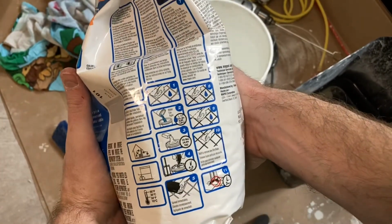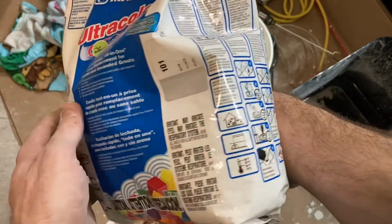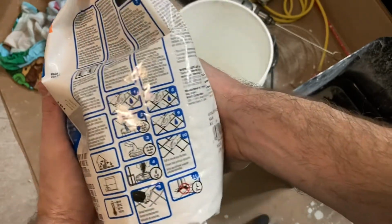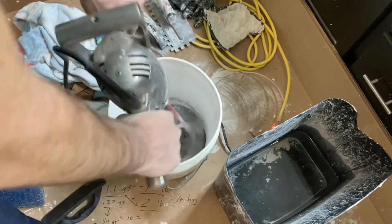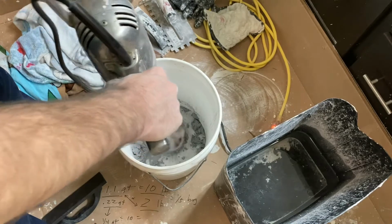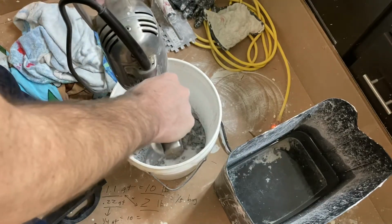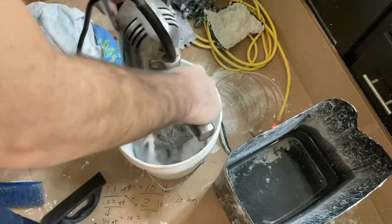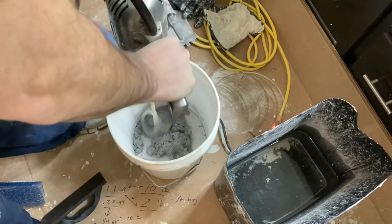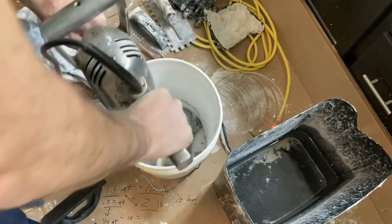And just a general tip here, before you mix a batch of this stuff and go all in, no matter what kind of grout you're using, brand and color and whatnot, make sure you do a test sample. I have a separate video out on how you can make a test sample batch before you invest a lot of money and time and potentially have a final product that doesn't dry the same color that you thought it would, or you have consistency issues. So definitely mix up a batch.